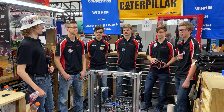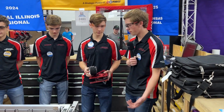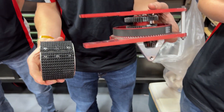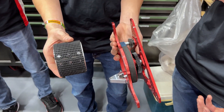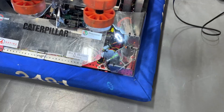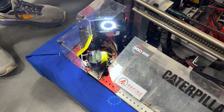Now we're going over to Andrew to talk about their custom swerve drive. In the off-season, we met and decided we want to have a custom swerve. We had run off-the-shelf modules for the past two seasons and noticed many things we didn't like. It wasn't truly off-the-shelf because for what we wanted, we always had to have some sort of customization. We noticed that all the other wheels slipped a lot, so we have a larger wheelbase to allow more traction and more grip to the carpet, allowing wheel odometry to be more accurate.